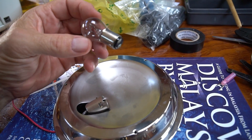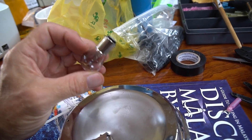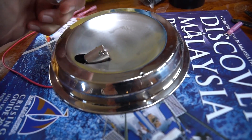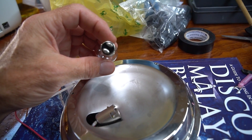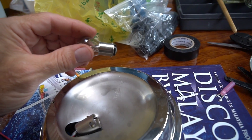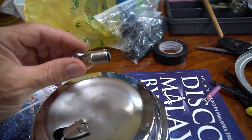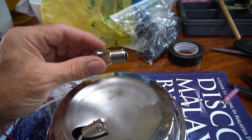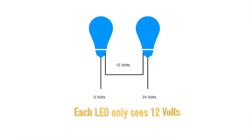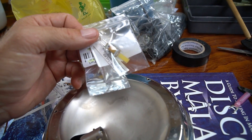Right here you see a bulb that is like a bi-directional bulb because both sides are the same height, so it fits in either way — plus or minus on either side. What we want to do is keep it so it's plus or minus on either side but change it to 12-volt rather than 24-volt. The way you do that is you have two LED bulbs in series. If you have two LED bulbs in series, there'll be 12 volts rather than 24 volts, giving you less voltage and less chance of overpowering your LEDs.